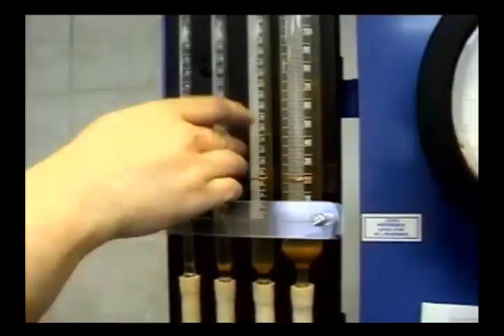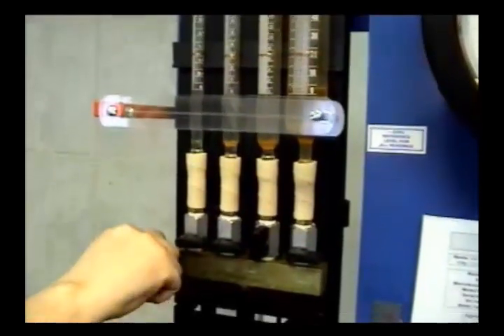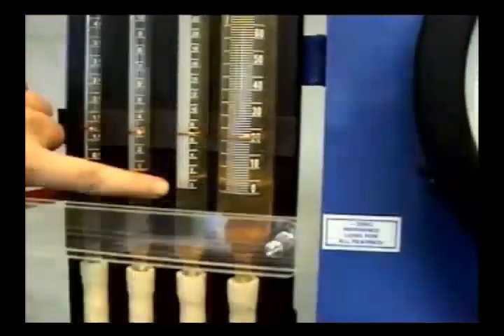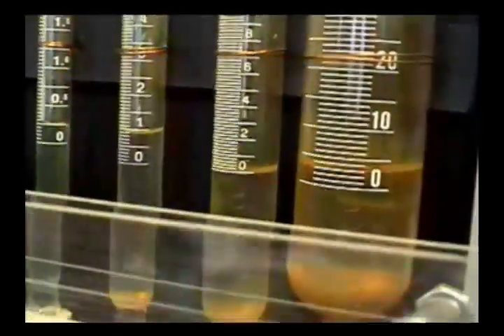Right now the whole system is bled out — I know it because I've closed off all the valves and there are no air bubbles coming out. The whole system is pressurized. We check for leaks just to make sure we don't have any, then we zero out our burette at zero and let everything sit for about five minutes to balance out.